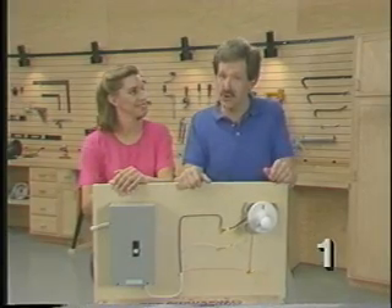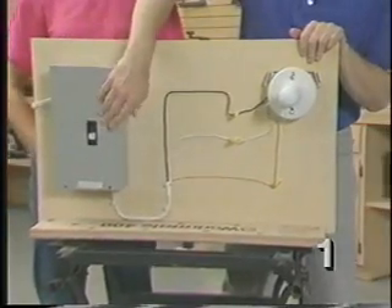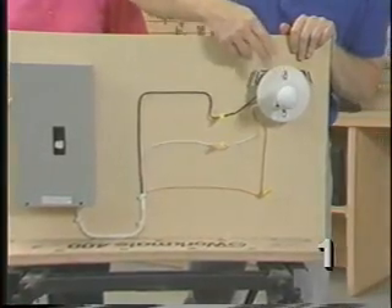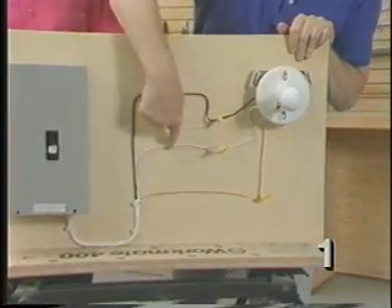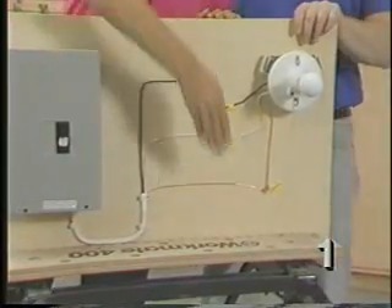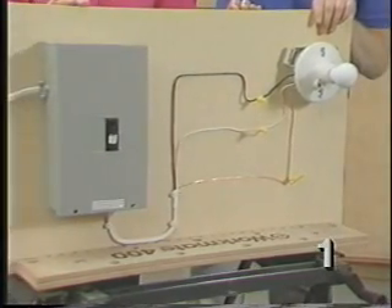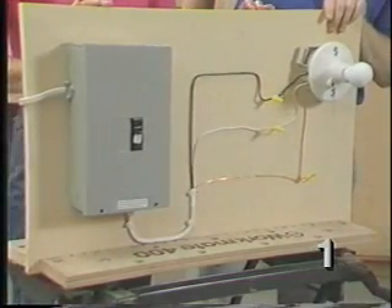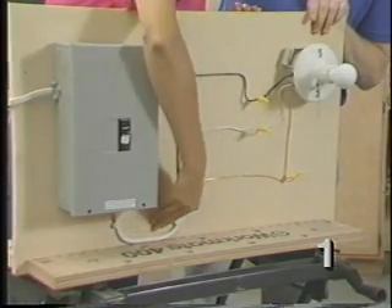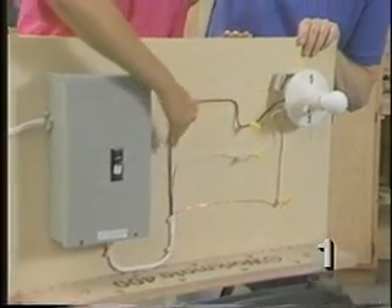These terms and colors are standard in all new wiring across the country. The hot wire brings the current out from the source — this wire is most often wrapped with black insulation. Once electricity has done its work, it goes back on the neutral wire, which is most often white. The ground wire offers current another path to ground in addition to the neutral, and is always enclosed in green insulation or is bare copper. Remember that electricity needs a complete circuit to work properly — a way out to the job called the load, and a way back.